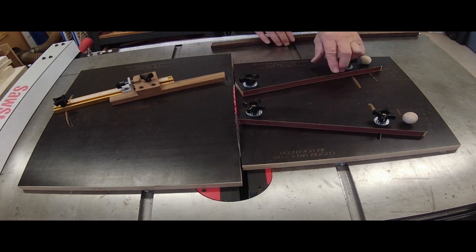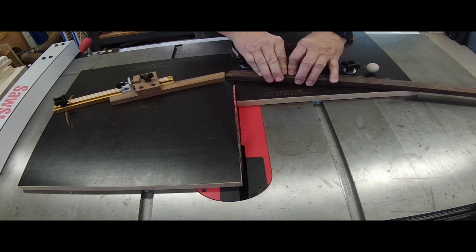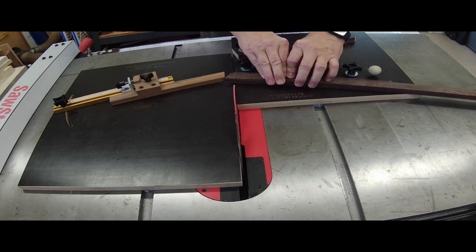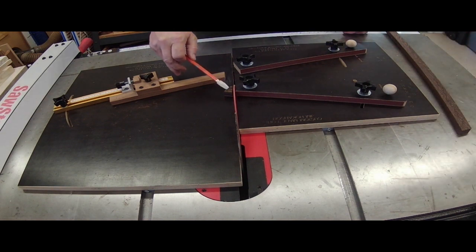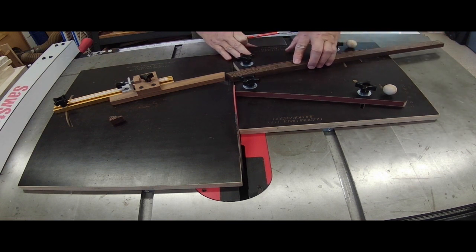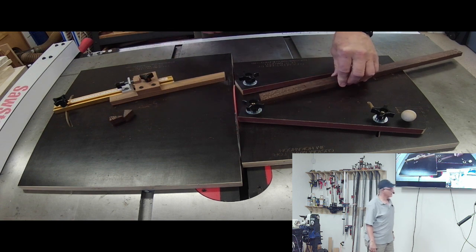The first step in making the feature ring is to cut the wedges. Here I'm using a Pete Mackin sled. The component on the left establishes the length of the wedge, and the component on the right establishes the angle of the wedge. I use a pencil to push the wedges out of the way so I don't cut my fingers.